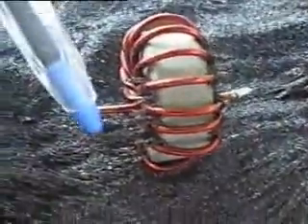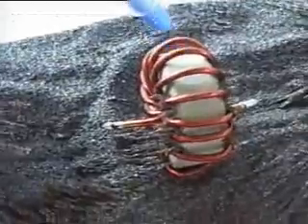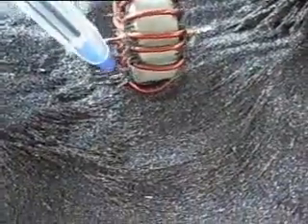Now I've got the toroid in a box of iron filings with a big stack of magnets on one side and some on the other side. You can see that when the toroid is facing the magnet, all these little domains are pointing more or less directly toward the magnet. When you energize the coil — as we saw with the needle swinging — what we're doing is turning those domains, displacing them so that the magnet here loses its attraction.